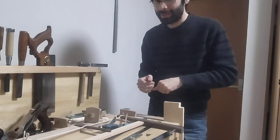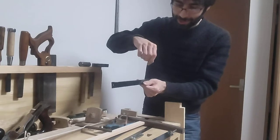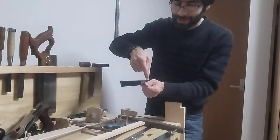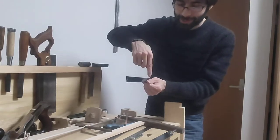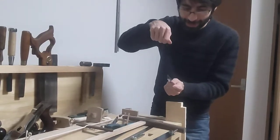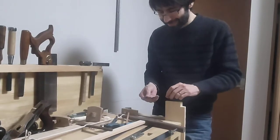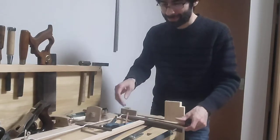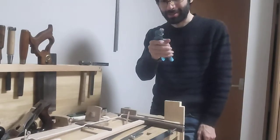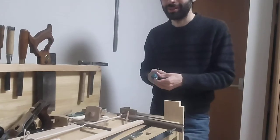There are many ways to do that. What I used to do with large teeth is take a flathead screwdriver, insert it between the teeth and twist. And then go to the next tooth and do the opposite way and twist. Opposite way and twist. That works great. It's a little dangerous because you can slip off the tooth and then jam your hand into the blade. And it doesn't work on thick plates very well. But a saw set like this is the easiest way, and the way I kind of recommend now.